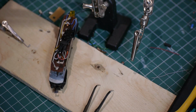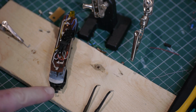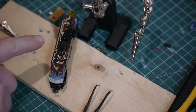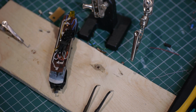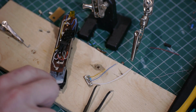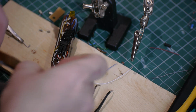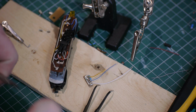Since the Loco chassis originally worked as a negative terminal and is still connected like that, I need to make sure that the lighting board is isolated from that board. And to do that, I'm just going to use some Kapton tape and trim it to fit.